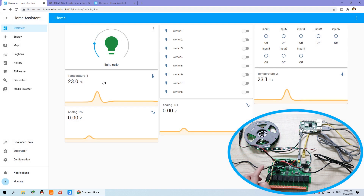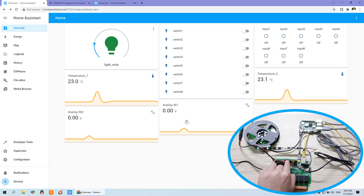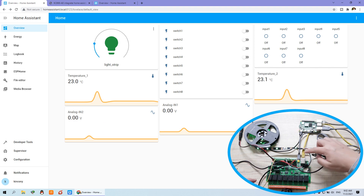You can also see the temperature sensor — DS18B20, there are two temperature sensors detecting temperature one and temperature two. And there are also two analog inputs. I have not connected a sensor, but you can see the analog input voltage, voltage one and two. I have integrated these functions into the A8 board with communication via the Ethernet port. And there are some free GPIO pins you can use.